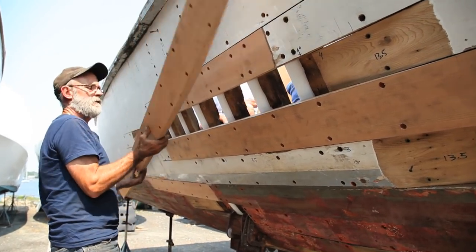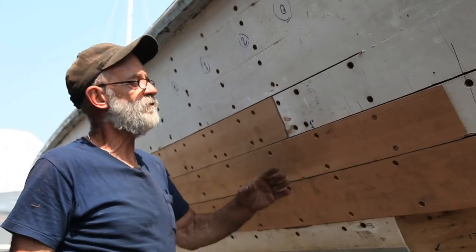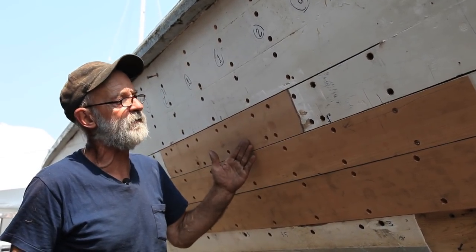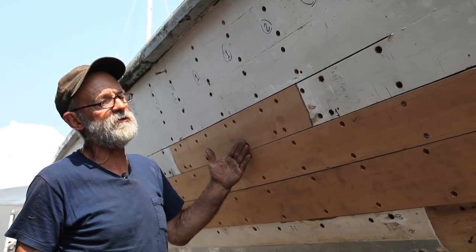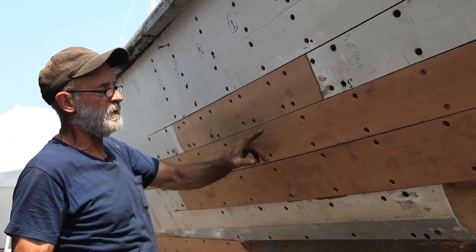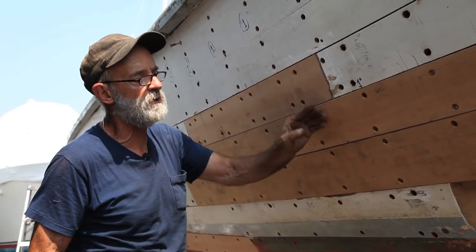I'd like to pick the next piece up and fit it in here. This is obviously a very effective way to eliminate the butt blocks and make the planks, in effect, all one piece from one end to the other. These scarves will never open up or show their faces in years and years. I've put them in in a very traditional manner, as if they were full-length carvel planks with the proper bevels in the proper positions. You can see I've got openings to put cotton in, but those don't go all the way through — they're only partial depth. It'll be traditionally caulked to match the rest of the boat and will disappear completely inside and out once it's painted.